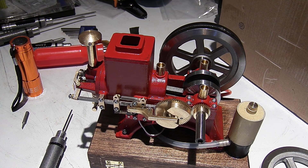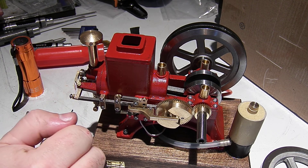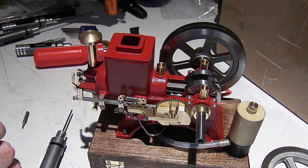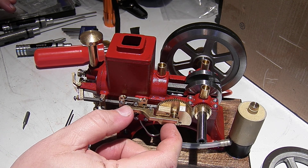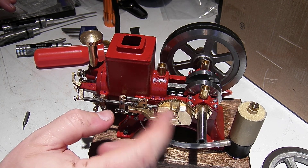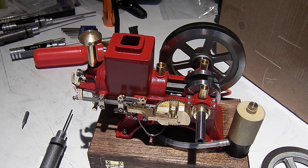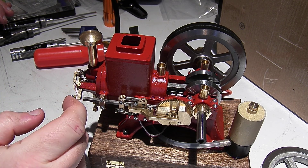Hopefully this will make the engine run a bit slower because this pawl will be able to hold the exhaust push rod open better. Thomas PC Guru's channel — he said he drilled out and put lead in the weights to make them heavier, but I certainly don't have facility for that. I think having a better profile on the latch here is going to be a good solution for slowing this engine down a little bit.